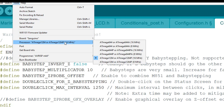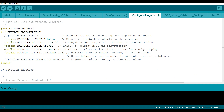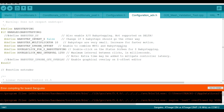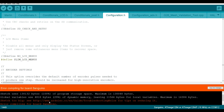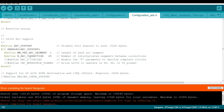We're going to make sure we have Sanguino selected and 1284P 16MHz, select our board, and attempt to upload — though we expect it to probably be too big and require disabling some features. We can see we're a little over 9,000 bytes over, so time to disable some features we don't often use. The easiest thing is to switch back to configuration.h and search for "slim". Let's uncomment this — it removes a lot of options from the LCD but you can still set these options manually in your gcode or when connected via USB. Not quite there but extremely close; we're at 100% so we need to lose just a little bit more. The next piece of low-hanging fruit is in configuration_adv.h — search for "arc". This feature is very rarely used in 3D printing so we're going to comment it out, and we should be good to upload.